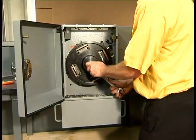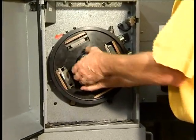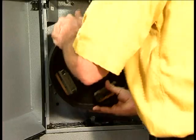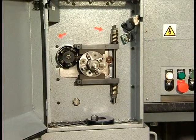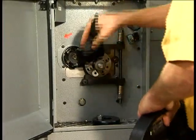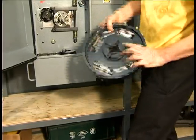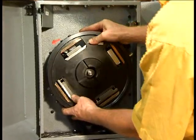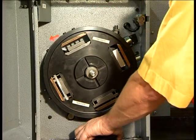On completion of this first cut cycle, the fixture is removed and cleaned before being rotated 180 degrees and reloaded onto the drive spindle. Care must be taken in cleaning the two locating faces of the rotating fixture, the four pads on the drive spindle, and the clamping collar locating face. These are important surfaces which ultimately determine the size of the specimen.